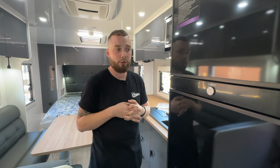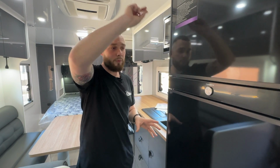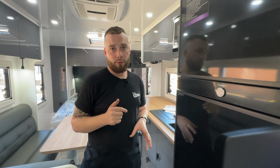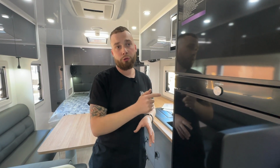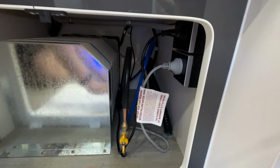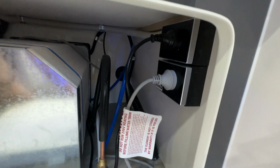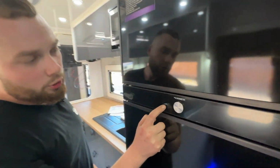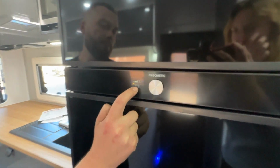They're not small dollars. So it gets its power feed directly from the battery that runs through the battery monitoring system, and it has a 240 power point that runs directly to the mains power. So our power point is located underneath here, and it is identified because it's a black lead, and we turn that off. So just for this demonstration, we're going to turn it off. Now, if we jump back up here, it has automatically gone to the battery, right?